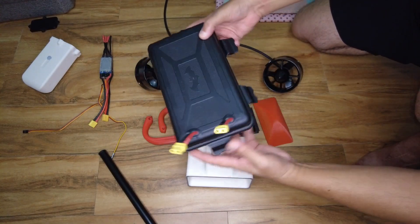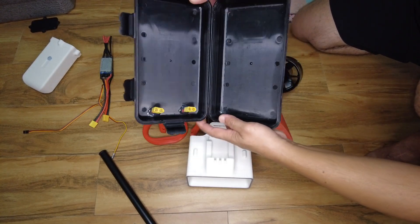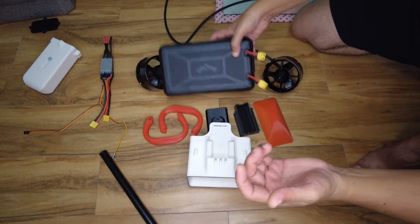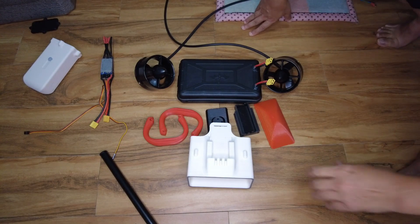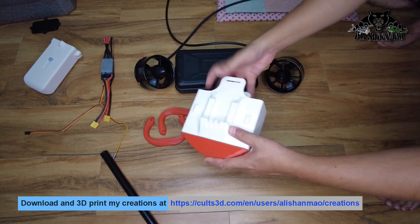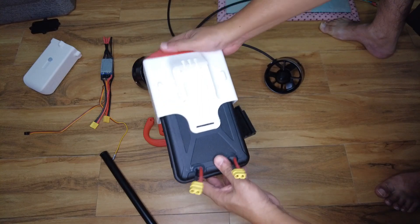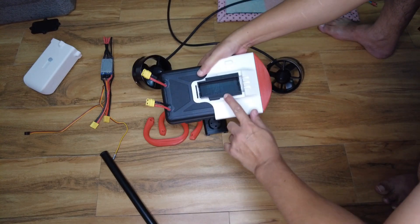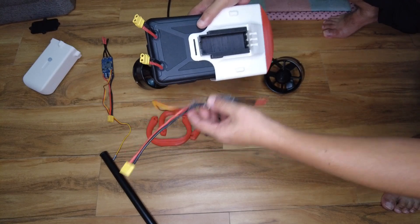So I had to go with my original idea to use this waterproof box that I bought — I've tested it and no water goes in. I'm going to put two batteries in it. I've also used silicone gel to seal the cables coming in and the XT60 connectors outside. I'll seal those as well using either a balloon-type cover or silicone sealing with heat shrink. This is the ESC box which will house a 40-amp ESC — I put silicone gel all over and they are properly sealed. I've tested them and they work underwater without any problems.